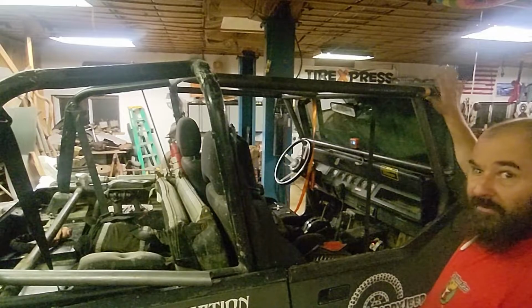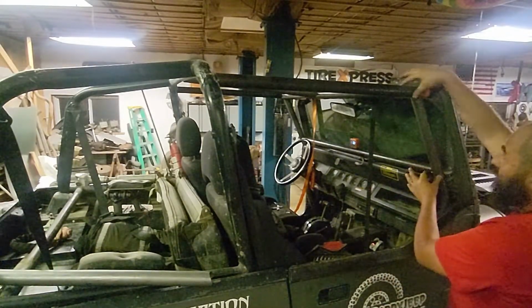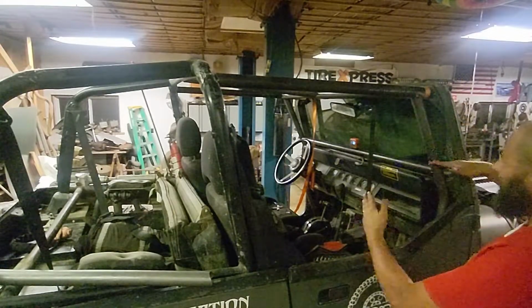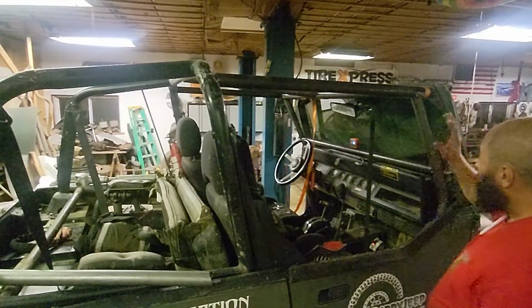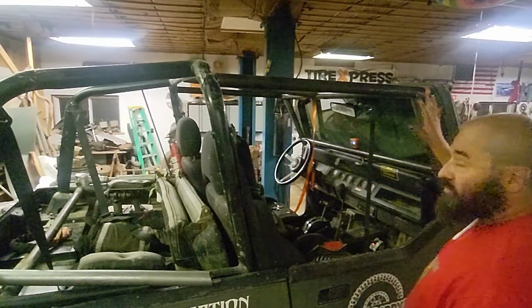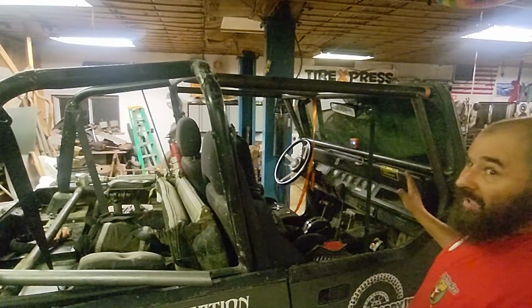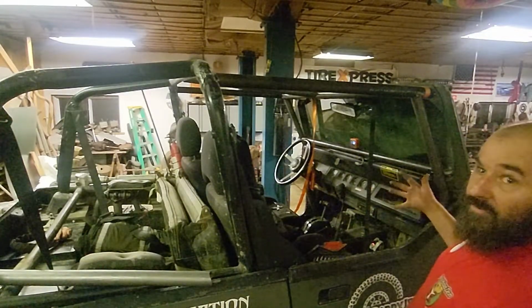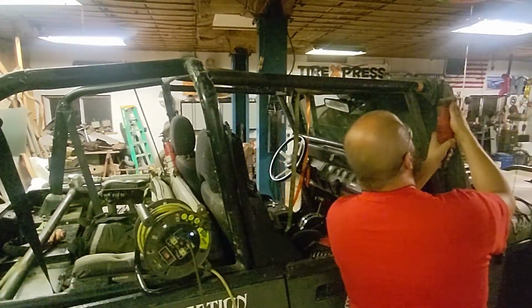Once I get this top centered and retacked, these two bars, once they're in place, are going to dictate the squareness of these upright legs. So I think by getting these two done and square first, my feet should come in. But again, I'm still tacking everything, so if this theory is wrong, we'll just cut the tacks and do it again.